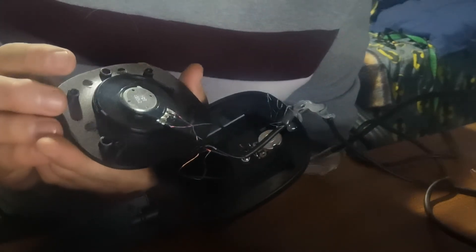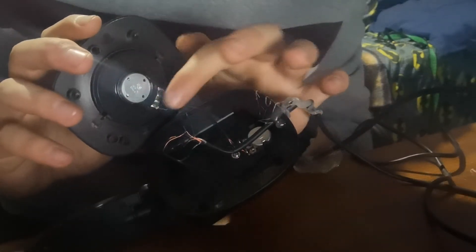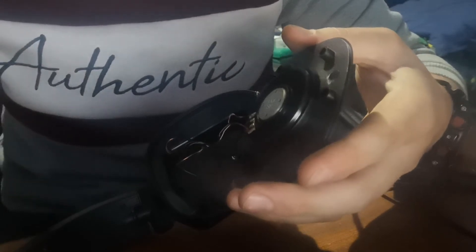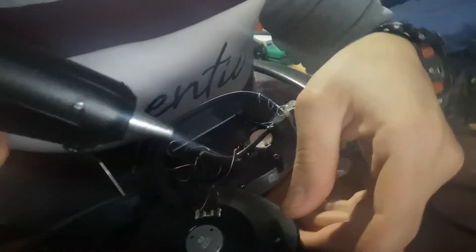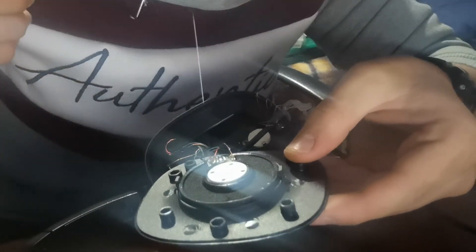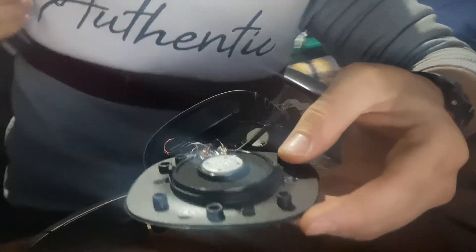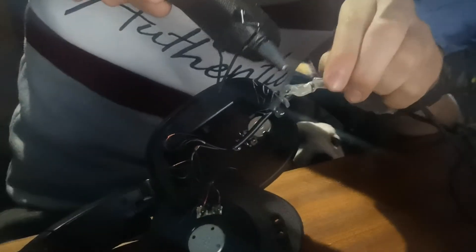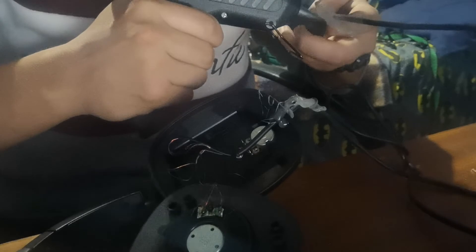We have a proper connection now — we can turn off the soldering iron. I'm going to use the glue gun again for insulation on this side. There we go — this worked perfectly and my connections are strong and solid. I'm not going to pull too hard because these wires are very brittle. When you have a glue gun on hand and you are doing connections, it usually works well when you isolate them with just a small dab — it sticks to the board and provides extra insulation.